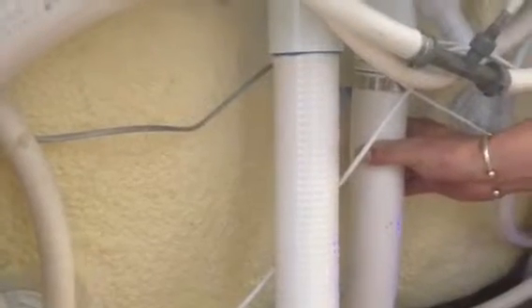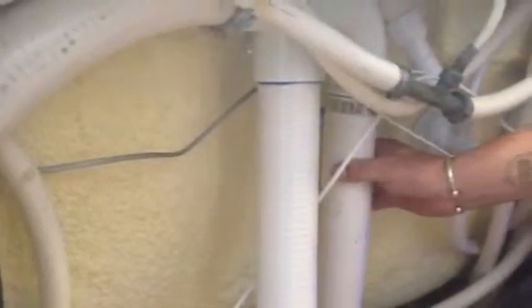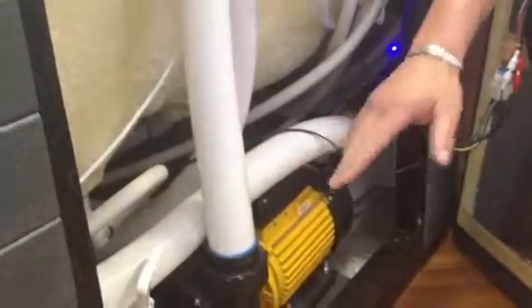There's a lot of different piping going in here which is all clamped and glued, which is a great feature. Some companies just clamp them or just glue them, so the clamped and glued feature means you're minimising the chance of blowouts. Underneath the insulation on your base you have what we call a vermin proof base, which is an ABS plastic material that staples to your frame — that's to stop mice and rats and anything like that crawling in there and having a go at your piping.